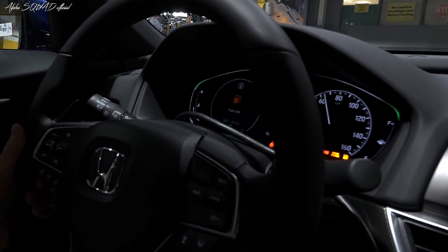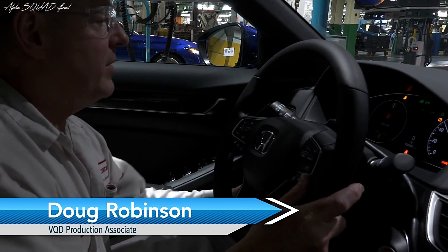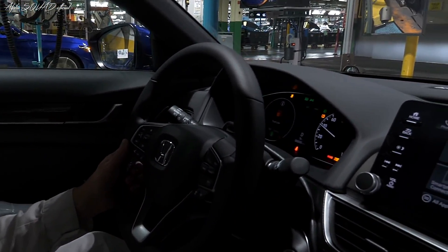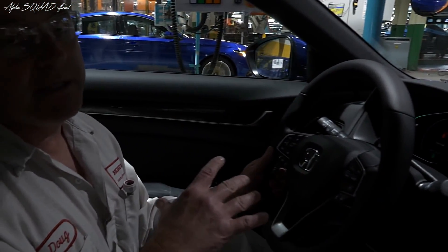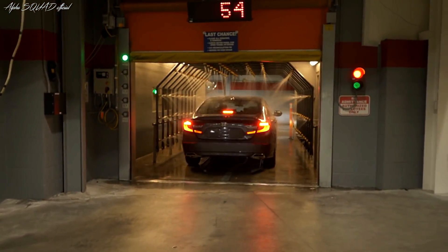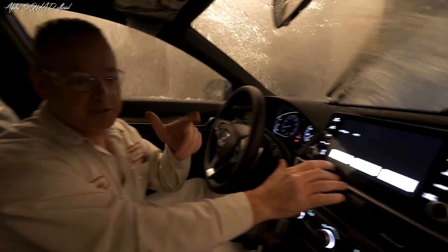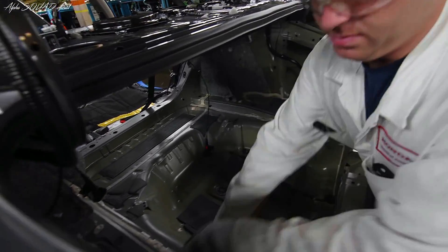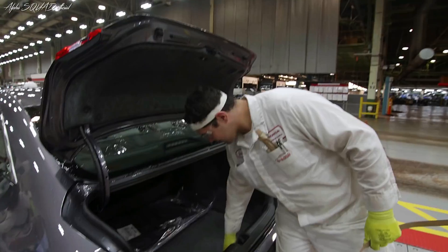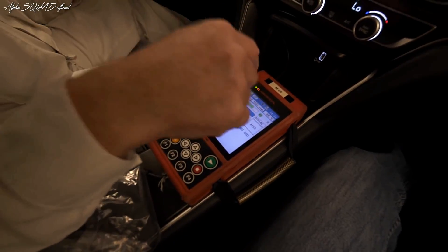Now we've got coast down without brake. I set the VSA button — it's flashing so I can't touch anything other than the steering wheel. It's going to set all the VSA, which is Vehicle Stability Assist. As I go in reverse, I'm checking brake lights and reverse lights. We also check features like cruise control to get ready to take the car outside through a shower tester booth. It puts 185 gallons of water a minute on the car. Placed in the car during assembly are little cardboard strips in the low-lying points — anything that would leak, the water would end up on that cardboard strip. I also check the spray of the windshield washer fluid.